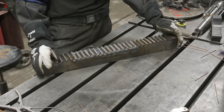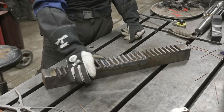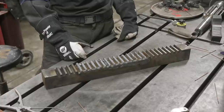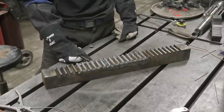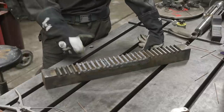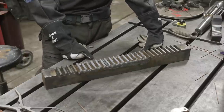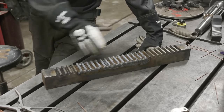All right, guys, we got this welded out. I'm really happy with how it turned out. Really, this is like 90% of what it could be. We welded for about 2 hours straight and used about a pound of TIG wire of the A2. You always want more when you're building up than you think you do. And in this case, I stopped like 30 minutes ago and then made myself do even more so that way we just have extra meat.